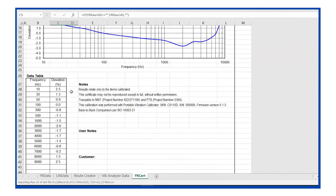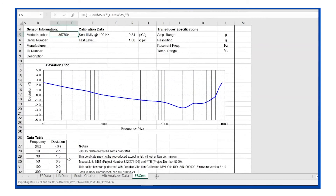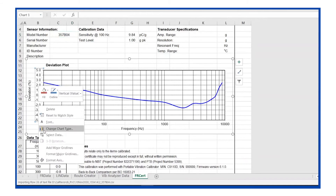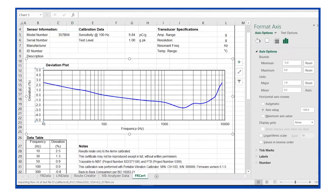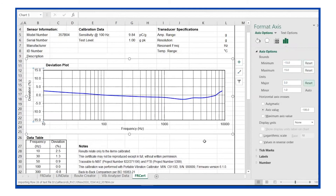Your eye is immediately drawn to the calibration line, which doesn't look super great, but the worst deviation I had was 2.6 percent down at 2000 hertz, 2.5 percent high at 10 hertz, and 2.5 percent high at 9000 hertz — all within the plus or minus five percent threshold. Because no values crossed the five percent threshold, the plot drew the deviation on a plus or minus five percent scale, which is very zoomed in. If I want this to look better, I'm not changing the data — I'm just zooming out in Microsoft Excel by changing the minimum, maximum, and major grid line bounds.